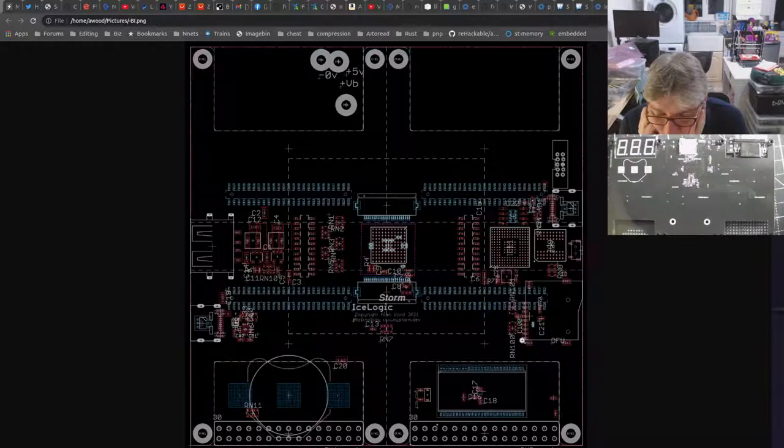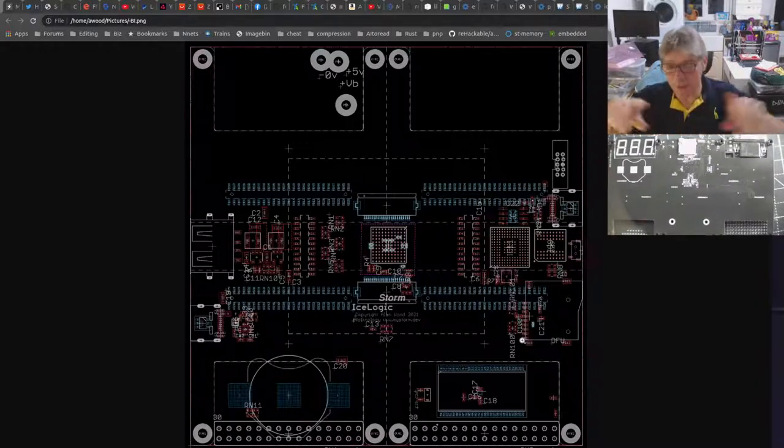We lose two buttons that the MX had. They were useful. I could add them on as right angle buttons along with the SD card on that PMOD. The double PMOD has 8 pins, 6 will be used for the SD card, so there's 2 left, which we can put 2 right angle buttons on. And again, they won't affect things if they're not used. You can still use the PMOD, you just have to remember not to press them if you're connecting something to the PMOD. But that was the same with the existing buttons anyhow.